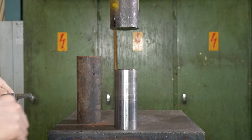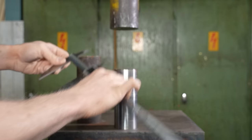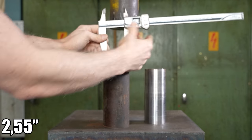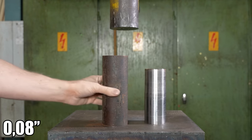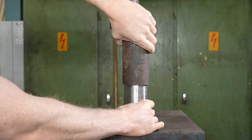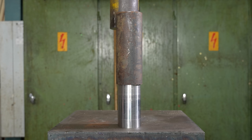From here down, this rod is about 65 millimeters, and the hole in the tube is 63 millimeters. So we are missing two millimeters. I have a smaller taper here at the start so I can get it going. I think it's going to go down and the tube is going to stretch by two millimeters. But how far can we take this if it's 10 millimeters too large? That's what we are going to find out today.